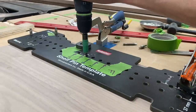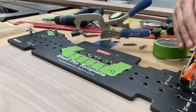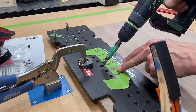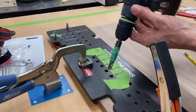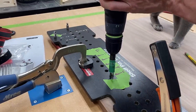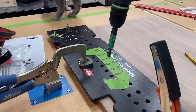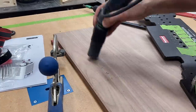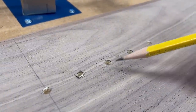Another thing I like to do before the case is assembled is drill all the holes for the shelf pins. I'm using this little Woodpecker's jig — you can make your own out of pegboard, or get crazy and mark, measure, drill, or eyeball it. A little tip when drilling these out: if you start the hole with the drill in reverse, you'll have much less tear-out. I'll show you an example — one started in reverse and one all forward. Much cleaner holes starting in reverse.